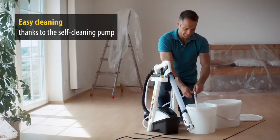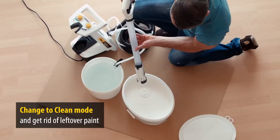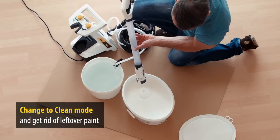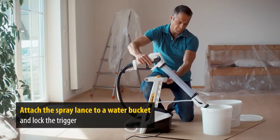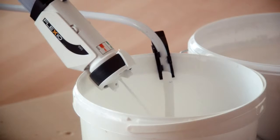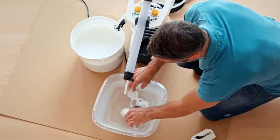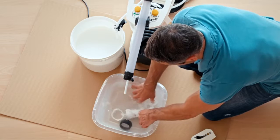When you're finished, the next part is simple. Change to clean mode and clip the suction hose to the water bucket. First, allow the leftover paint in the system to flow back into the paint bucket. As soon as you see water flowing through, change to the water bucket — the feed pump cleans itself in next to no time. All that's left to do is briefly rinse the spray head and everything is spotlessly clean.